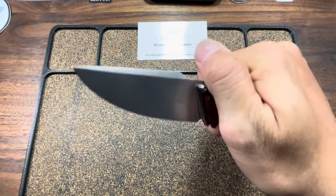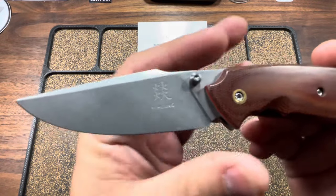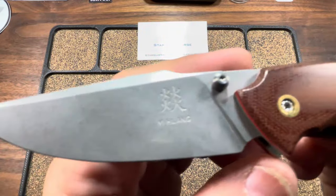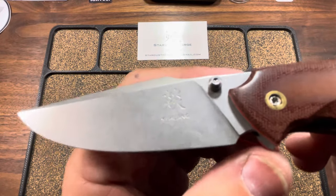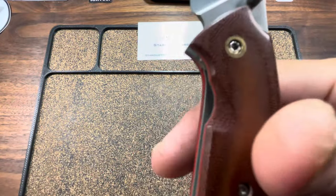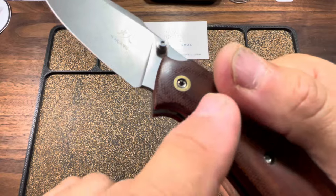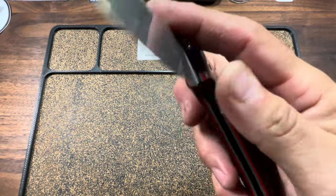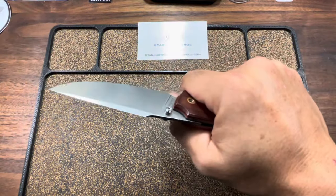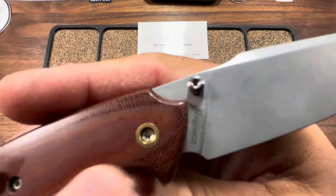Let's go with the front flipper — woo! The detent is down. Look at that blade, people. Beautiful drop harpoon-point blade. Holy shit, that is fucking thin behind the edge. There goes his maker's mark: Yi Huang. Nice stonewash finish on the blade. This is a liner lock riding on washers, with plenty of room for disengagement. Love the way he chamfered back that show-side scale with a nice little ramp to give you some access. That is fucking smooth, people. Thumb stud deployment is just as enjoyable. He knows how to make a detent, that is for sure. There go the brass pivot collars — such a nice touch.